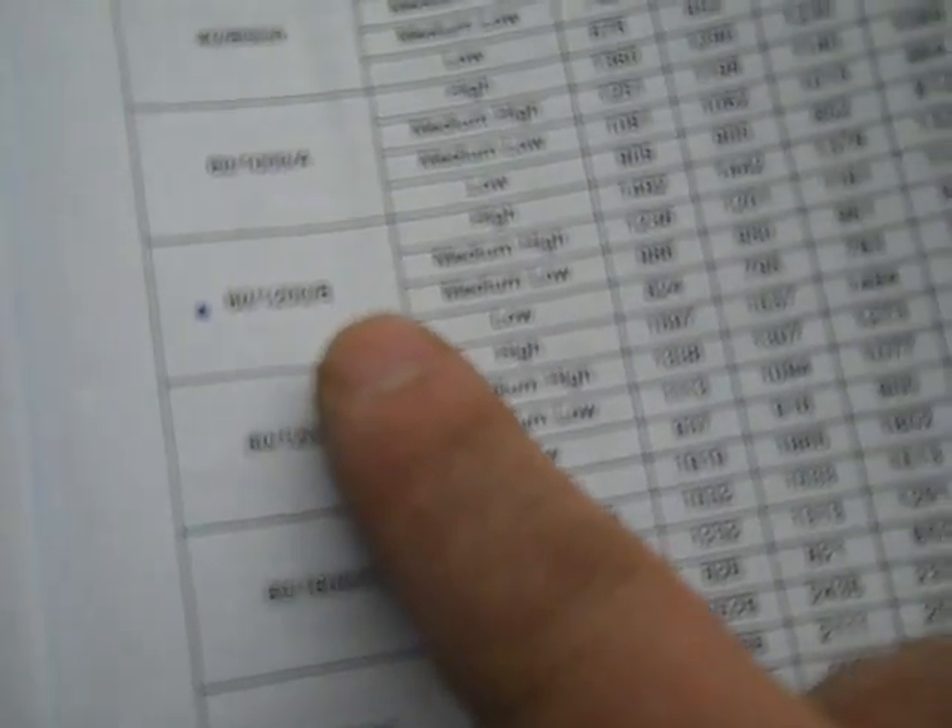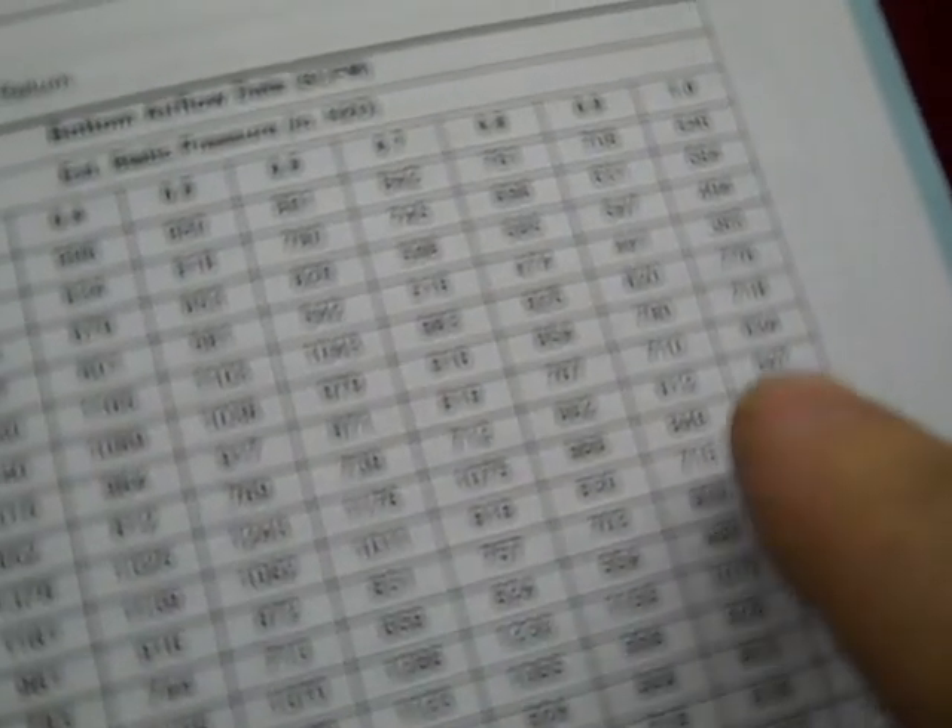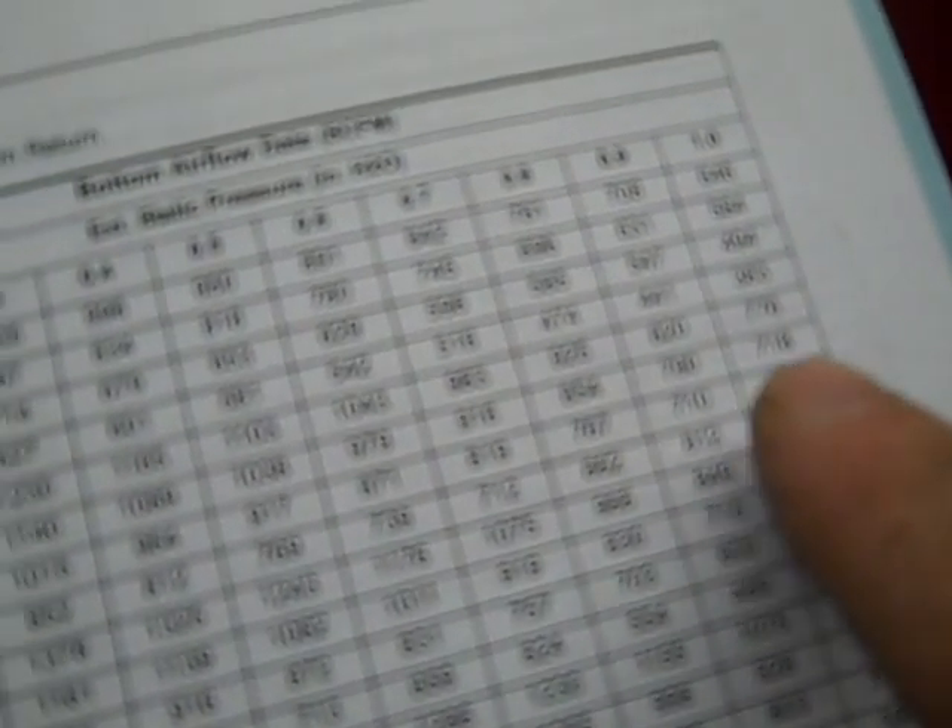So a little over 1 on high - that's not so great. This is a 60,000 BTU furnace with a 3-ton blower, and on high, all the way over at 1.0 - where you should never be - it's moving 655 CFM. So I'm probably going to have to do something here. I'm going to have to cut a register in. We'll go over here to determine which side is the bigger problem. I'm guessing it's going to be the return.